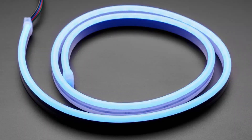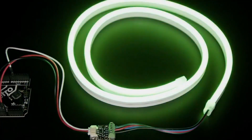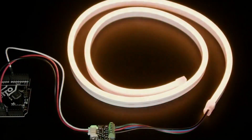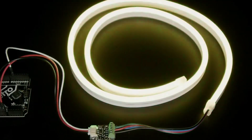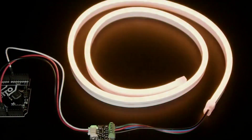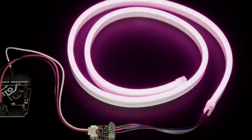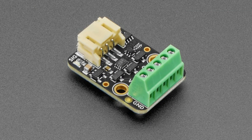So if you have these RGB neons or an RGB LED, especially ones that take 12 volts and you want the whole thing to light up the same color, you want to control it as if it was a NeoPixel. This has the three high voltage, high current transistors, the WS2811, and now it includes a level shifter. So if your NeoPixel signal is three volts, it'll work much, much better. Before it was a little bit flaky at three volts — it worked great at five — but now it works perfectly at any voltage. I just rearranged the parts a little bit. Great for making your RGB LEDs into NeoPixels.